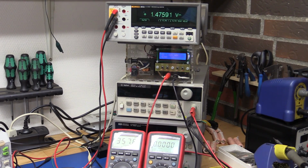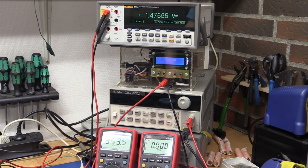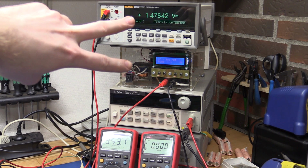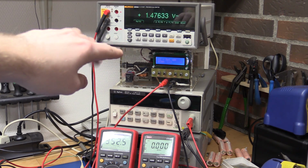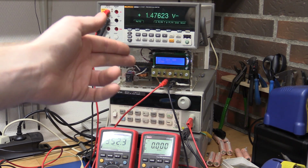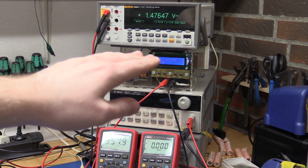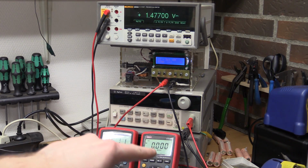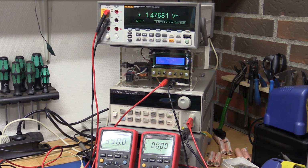But so let's try and calculate the efficiency at a few different currents here. So for this we'll be using 4 multimeters. The 2 up here will measure the output. We know that it's going to be 200 milliamps, even though the load doesn't show entirely accurate on the readback. It is 200 milliamps. That is actually pulled into it. And the input voltage and current will be measured by these two. And it looks like my battery is running low. Would you believe it? So I'll just go and change that before we do the test, of course.